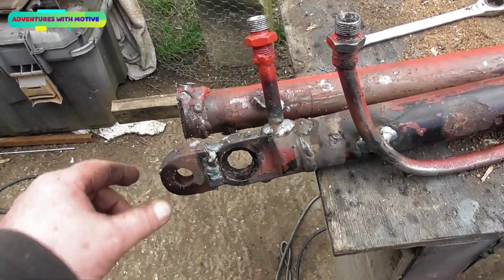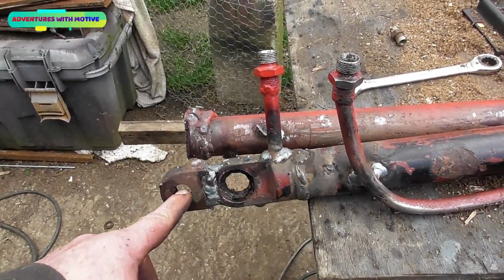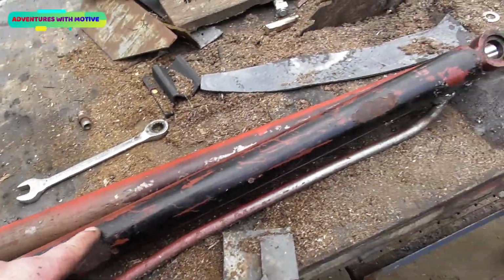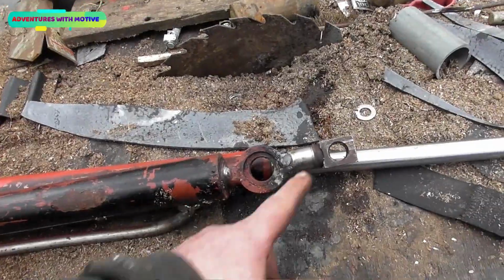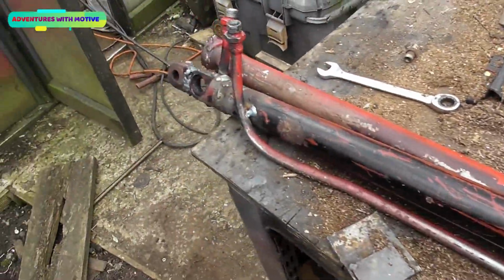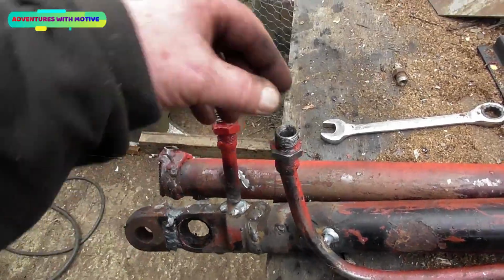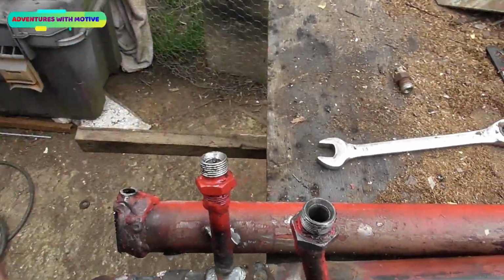The pipes are welded on. The reason I added that, and you can laugh at that all you like, I don't care, is the hole size is different on that one. I needed that hole size, and that ram is the best part of 4 inches longer than this ram. So the bolting points on the slide out, I've got to re-drill anyway. I should have cut that longer. I've actually extended a little bit, and I'm not worried about what it looks like. I just want it to work. That's all I'm interested in, and I have all faith in this.